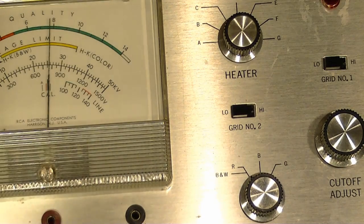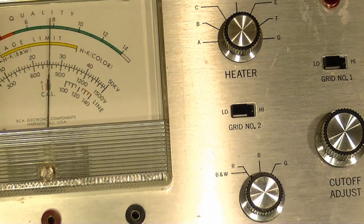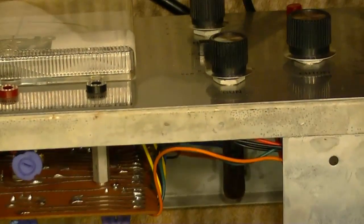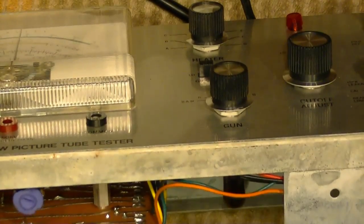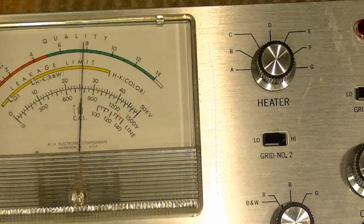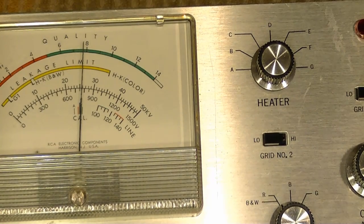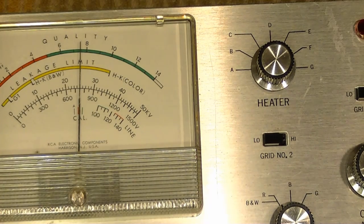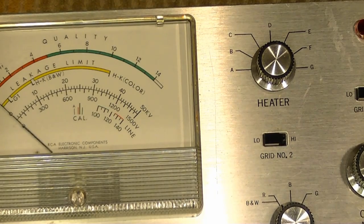So, actually this is pretty close to that black line as it is, but I'll tweak R23 regardless, if I knew what R23 was. This guy right here, the third one from the left. So, just want to move it a hair. Right there. I'm going to turn off the tester because the resistor is starting to get stinky.